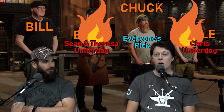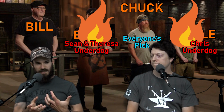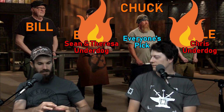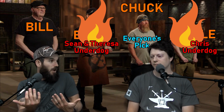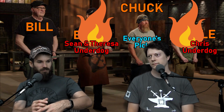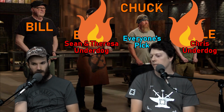I'm like, baller. The one thing I would be concerned about, and I'm sure he could fix it after the fact, is that I didn't really see the end of the tang. I don't know if he was going to leave a spot that was wider to help hold the metal on there. If it was a regular tang that just gets skinnier as you go, there's the possibility that even if it's cast around it, it wouldn't necessarily hold if you were swinging at something. Right, especially if it's tapered, it could slide right off. Again, I didn't get a good look at it, so it's hard to say what happened there.